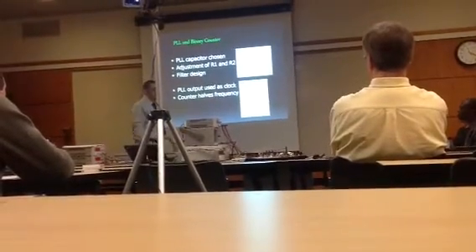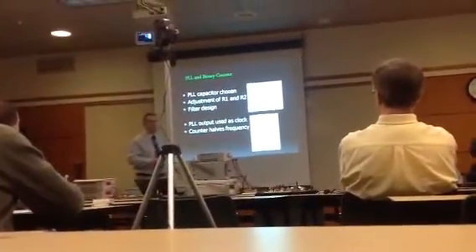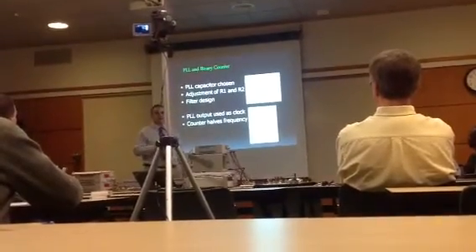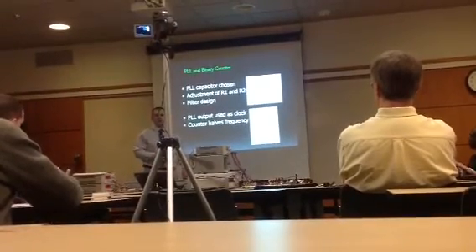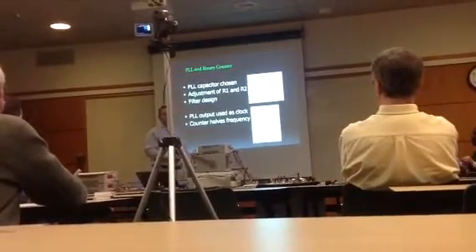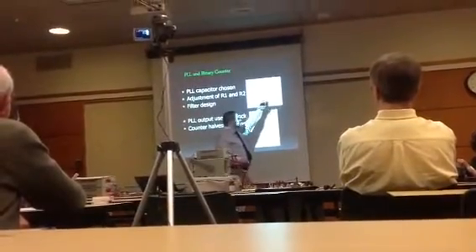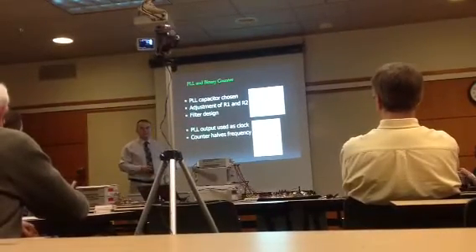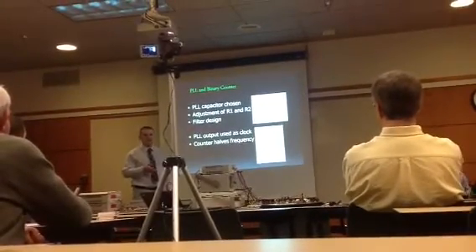Next, the signal goes into the PLL, which is a finely tuned device. We needed to adjust the phase shift to ensure that the carrier and the PSK data are either in phase or 180 degrees out of phase, depending on which bit is being processed. This involved adjusting resistors R1 and R2, which connect into the chip, and they were tuned manually after choosing a capacitor design.